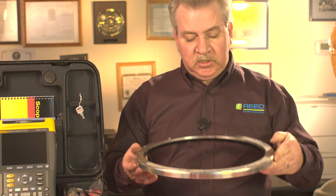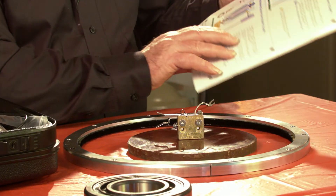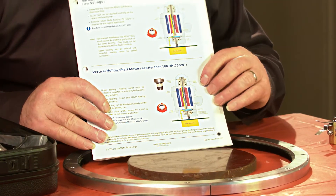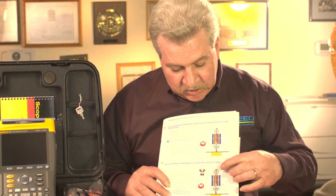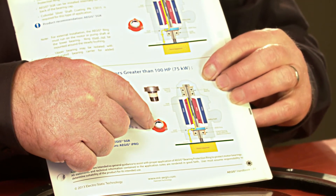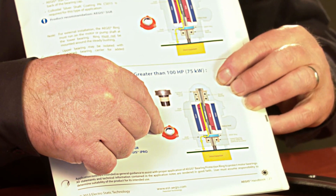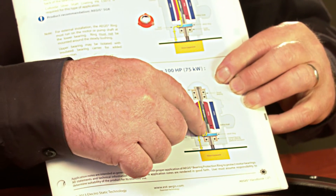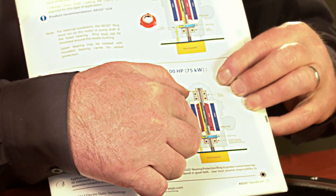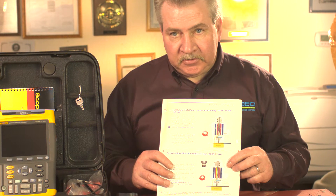The Aegis brush design can be utilized inside of a motor. For a vertical motor, I would recommend actually insulating the bearing carrier for the thrust bearings, and then installing the Aegis grounding brush assembly inside the bottom of the bearing cap — at the bottom of the motor. This shunts any current or voltage past the bearing before it gets to the lower bearing, and by insulating that and having it flow through down to the framework, it works very well and eliminates about 90% of the currents.